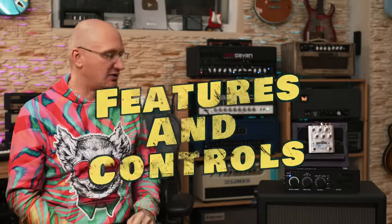And B, something that Luca just taught me, is that back in the day when attenuators started, they were all resistive. And Van Halen, Mr. Eddie, pumped his 100-watt Plexi, cranked it up, got the brown sound, and pumped that into a resistive load, which had a certain kind of roll-off in the top end and bottom end that gave it his sound. So if you're a die-hard Eddie man and you want that very classic, I make my amp quieter but with the resistive load, that's when you need that. So A, budget, and B, you want that very classic old-style attenuation.